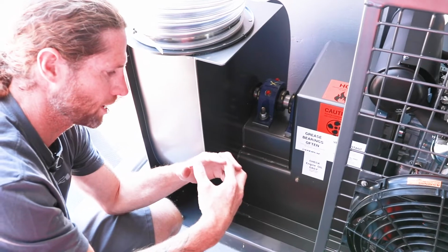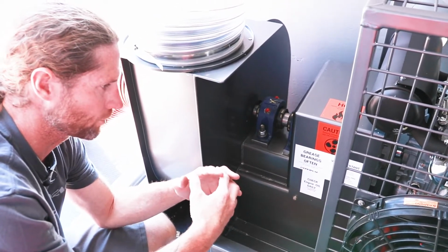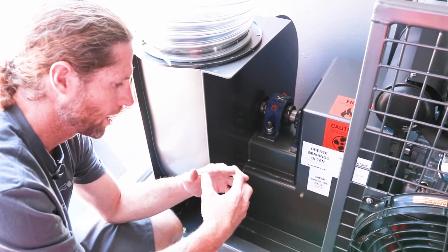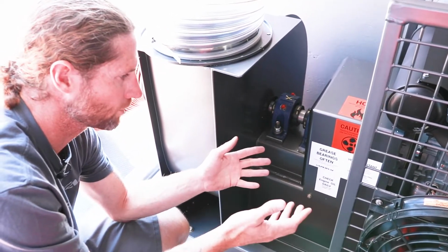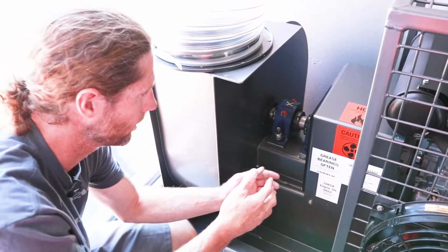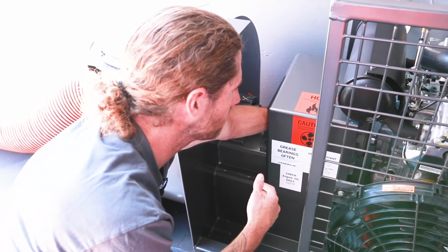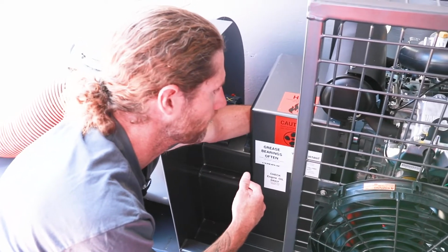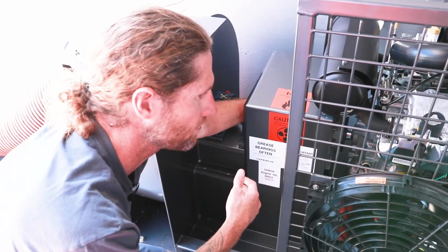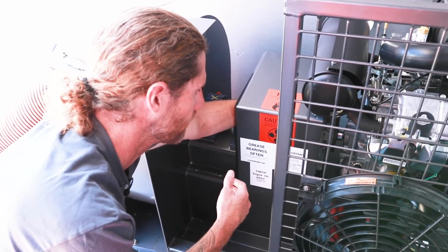And between those teeth are some little rubbers in there, and they will wear out. They should last you about a year, but you're going to want to check that periodically. I tell guys when you're doing your oil change, just check your rubbers as well. And that's simple enough, just reach your hand in and give it a little push. And you'll feel a little bit of play in that. There's not much play right now. This unit's brand new and there's not even a 1/16th worth of play in that.